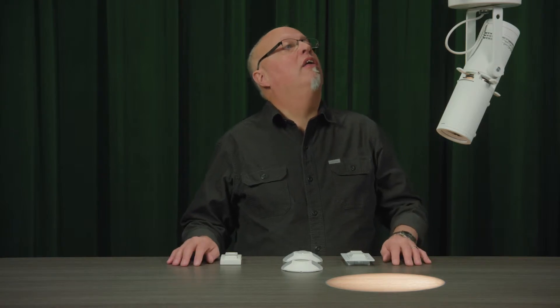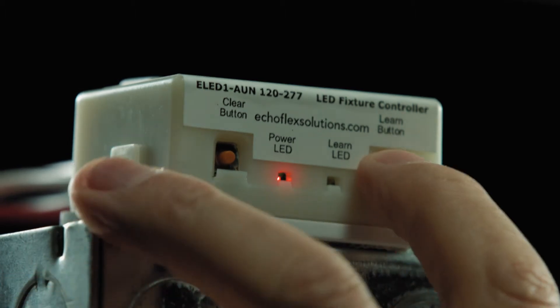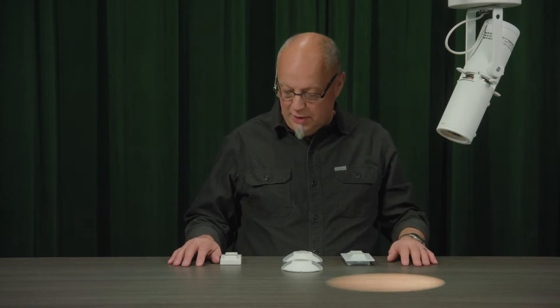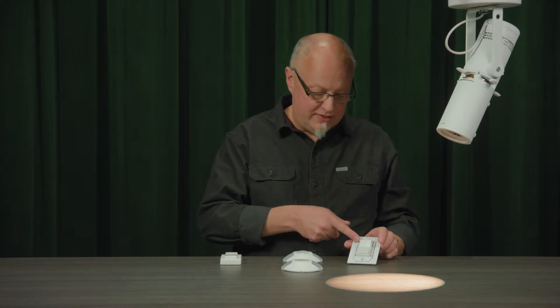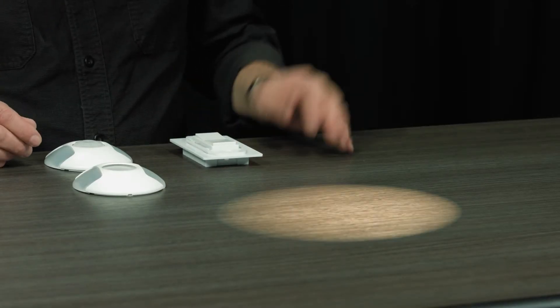The red LED is solid on my controller right now — it's in its factory default state. In order to put it into learn mode I simply press the button and release, and the relay will start cycling and the light will be turning off and on, as you can see here on the table. I'm going to take my first switch and triple-click the on side of the switch. You'll notice that it paused for four seconds while it learned in that relay.